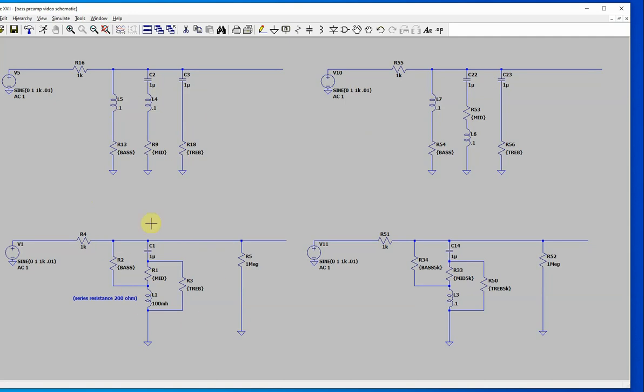That's a different video, but let me back up for a second. The reason I'm using this type and not just an ordinary tone stack is, number one, the tone stack has a mid cut in it. Even when you turn the mid range up all the way, there is still a mid cut. For bass guitar, sometimes people even use straight signals. I know I have before, and I've heard good recordings that way. I don't think I'd want a dip in the mid-range all the time. You might want that, you might not. Certainly in guitar that's more acceptable, but I like to be able to EQ the mid-range all the way up.